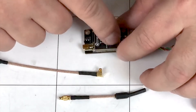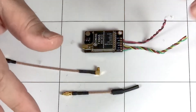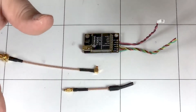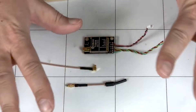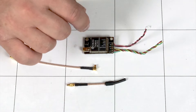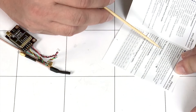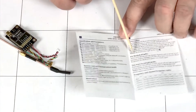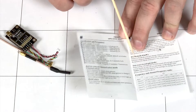What's great about this video transmitter is, as I mentioned, it has all kinds of power outputs from 25 to 800 milliwatts. So it doesn't matter what you're doing for flight — if you're doing freestyle, you crank it up; if you're doing a race, you crank it down. I was initially noting a lack of pit mode, but checking the documentation, there is a pit mode listed that drops it down to 0.01 milliwatts. So that's not even a negative because it does have it.